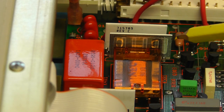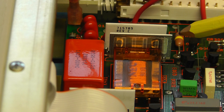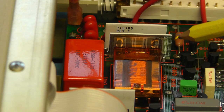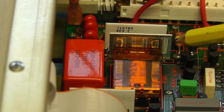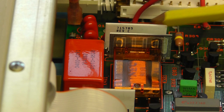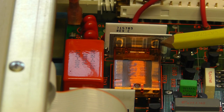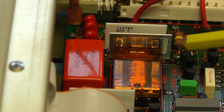Okay, there you can see one of the thin film resistor networks, and you can just about see the intricacy of the circuitry on that. It's on a substrate of white ceramic, and then it's coated with some quartz, glass type material. It's sealed from the environment, so that's all sealed. But obviously with it being clear, they can actually laser trim those resistor networks in that module, and by burning off some of the print underneath with a laser, they can increase some of the resistor values by taking off some of the shorting links on that.